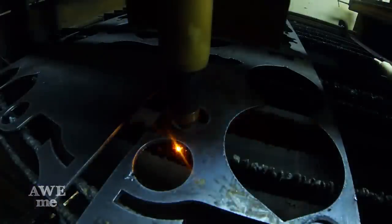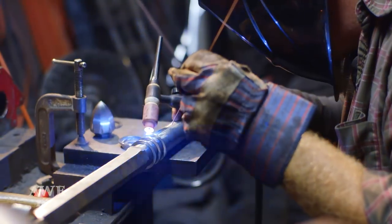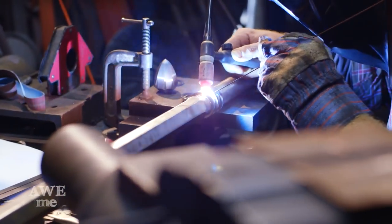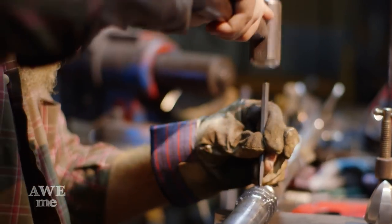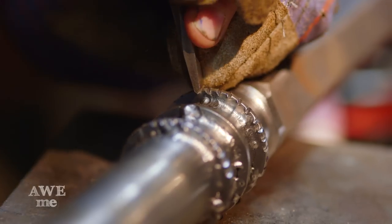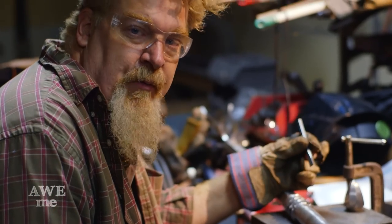To fit the rings for the handle, I'd force them up the shaft and weld them in place. I chisel the rings on the handle — a technique called roping. You'll see I'll be rocking the chisel back and forth, not just making a straight down cut. When you rock the chisel, it gives a rounded appearance in the bottom of the cut, which is more like what a rope would do.